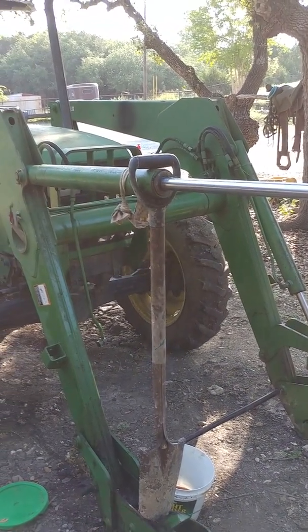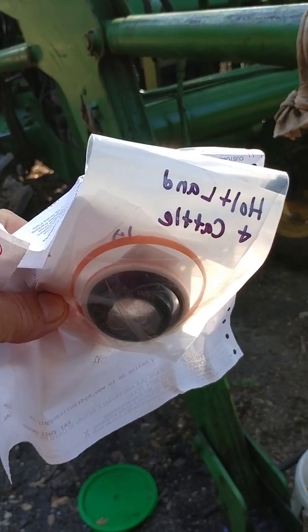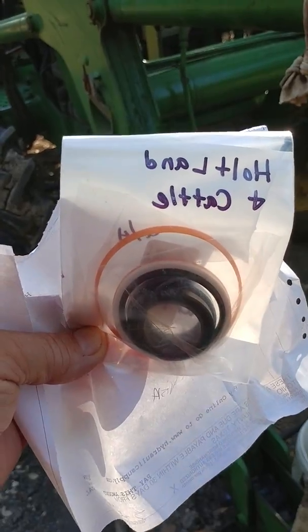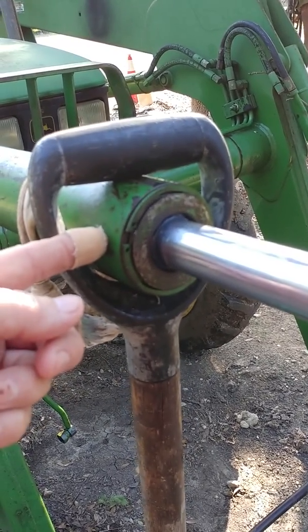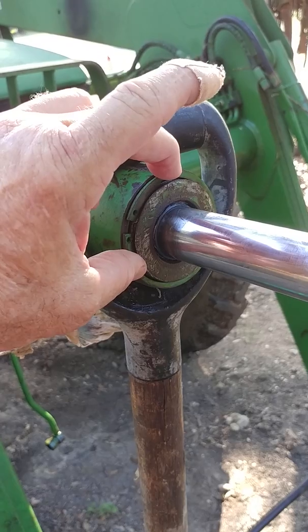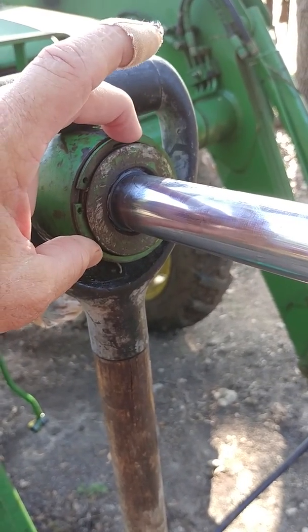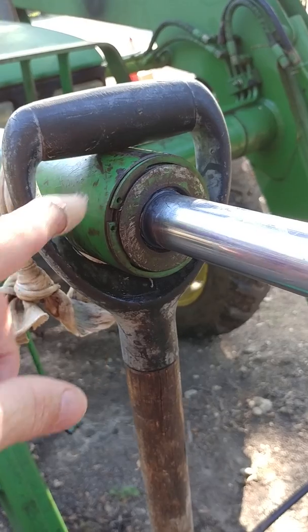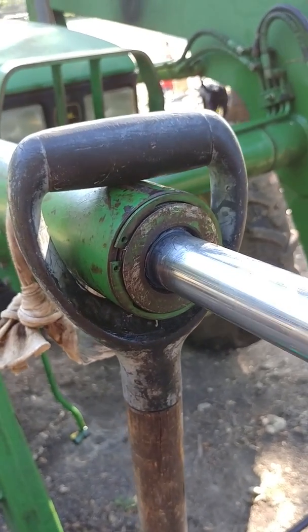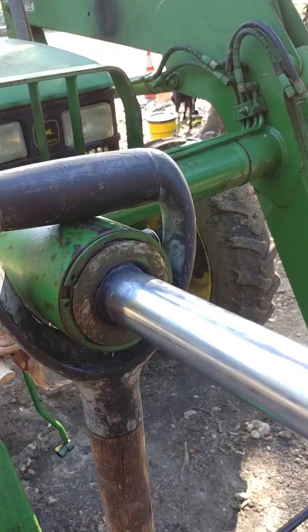This is a John Deere seal kit. That big plastic ring with a bevel on it is actually the tool included in every kit. Inside the cylinder, about an inch in, there's an internal snap ring groove. When you take the snap ring off the outside and try to pull the cylinder out, the internal snap ring catches and prevents removal. So you take the snap ring off, drive this plastic plate in about an inch, and you'll be able to see the groove for the internal snap ring. This is really important — if you don't use the tool correctly, it will get destroyed, and as far as I know, they won't sell you a replacement tool individually; you have to buy a whole new kit.